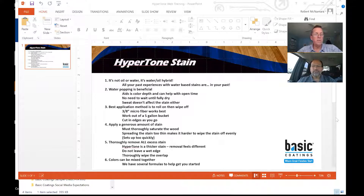What about softwoods like pine, fir, etc.? Do you have to do any extra prep work? No. But I do get a question about whether this will erase sander marks like water popping can sometimes do. The answer is no. You still have to sand the floor accordingly so that you don't see the edger marks or sander marks that the stain would normally highlight with any other stain on the marketplace.